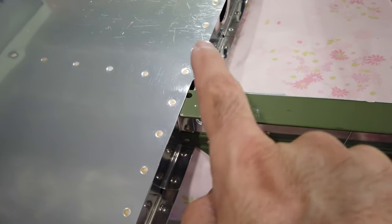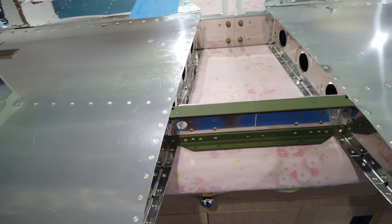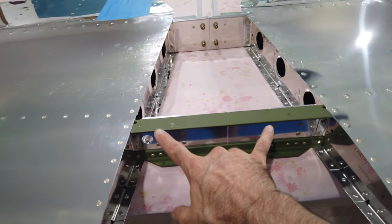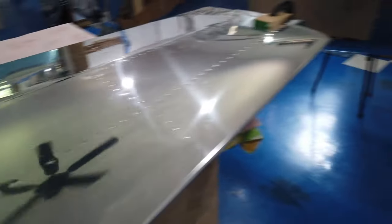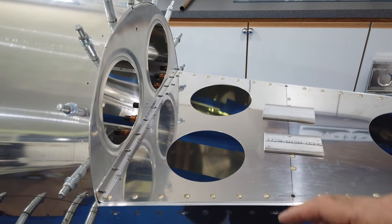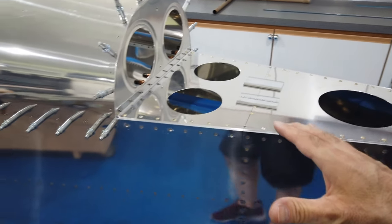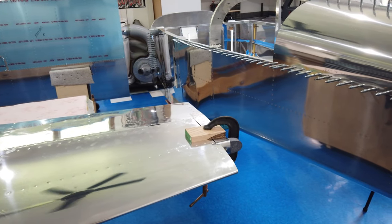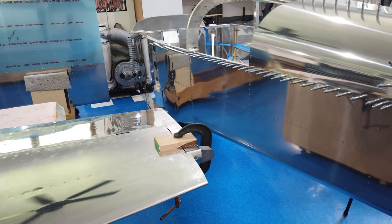I'm more than pleased with these. I'm going to go ahead and drill these, put this back up on the fuselage, and run a couple of bolts through there to see what happens. I'll drill these holes, put it back over on the fuselage, use the spacers, drop the bolts through. Once I get the bolts through the assembly and get it clamped back here, I'm going to check my measurements again from the fuselage back to make sure it's still perpendicular to the fuselage.